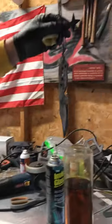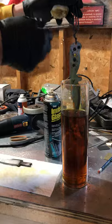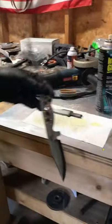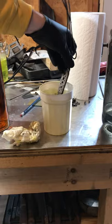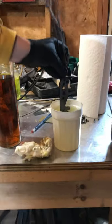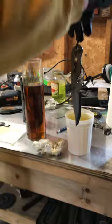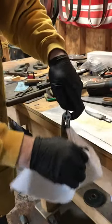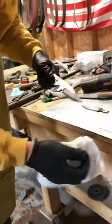Thanks for looking and thanks for tuning in. We'll give this another dip for a little more solid of a reveal. Every time you go back in, you've got to re-neutralize — get the acid off. The Windex isn't always a necessary thing; a lot of times just dipping it in a concentrate like this with some ammonia and running it under cool water is usually enough. You'll see all the black come off as I do that — this one's a done deal. I'm real happy with that etch, it's nice and dark. Probably go through and buff this up a little bit.